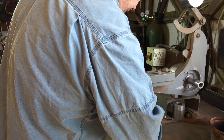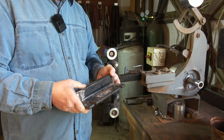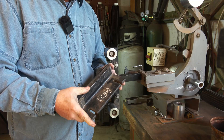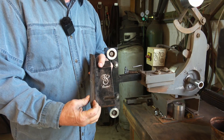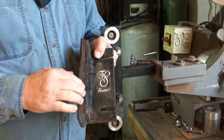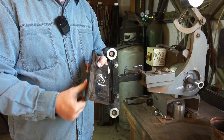Let's get this thing off of here. What you have to realize is these grinders are old, and the way they did platens back then was basically a piece of angle iron. This is the way it came, minus what you see right here. I put a thicker plate on the front to help as a heat sink, had it surface ground, and then put the glass over that.